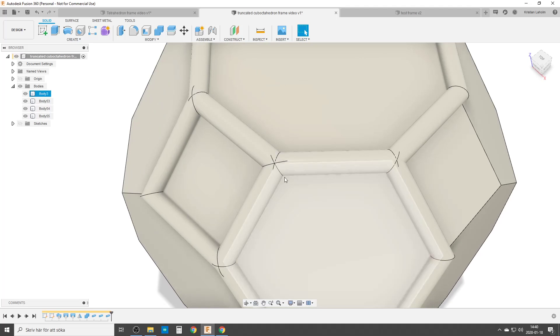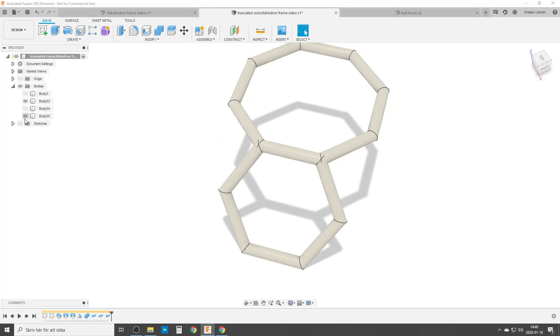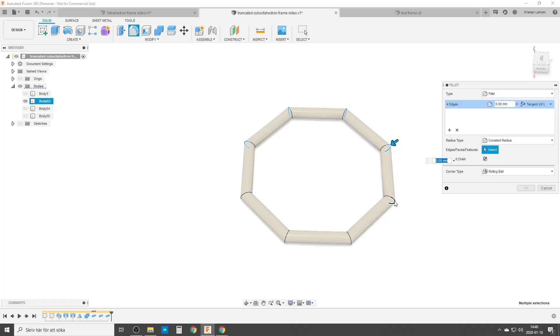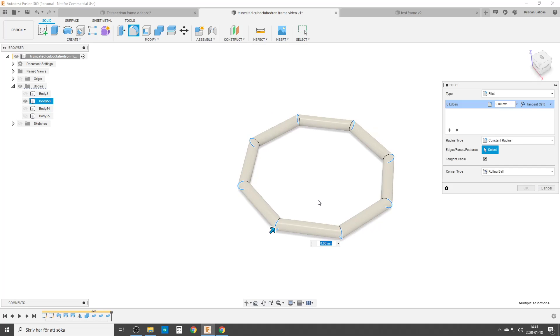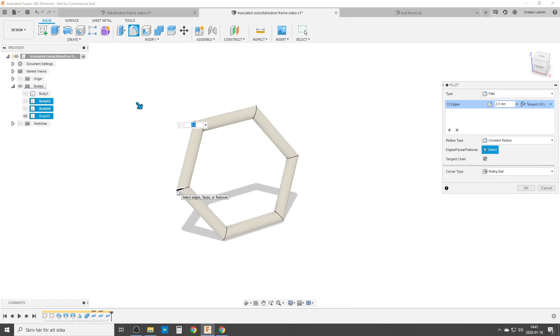You can see things poking out through everything. So we're going to turn off the first body — we don't need it right now. We're going to turn off these two and go in and do some fillets again. This is a bit dependent on which solid you're working with and how much you want to do this. I like to do it — it gets a smoother look. This one was 5mm, so it's going to be 2.5mm. Holding down control, choose the edges. Turn off one body, turn on the next. All the outside corners — and we are done.